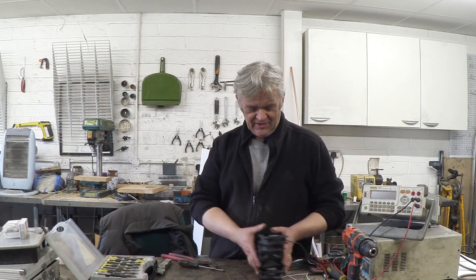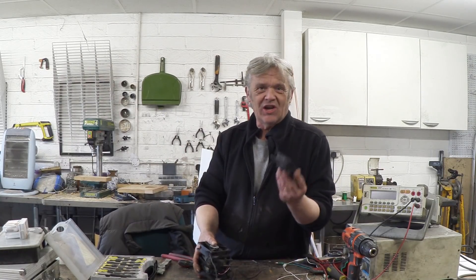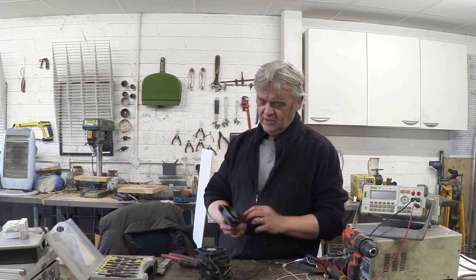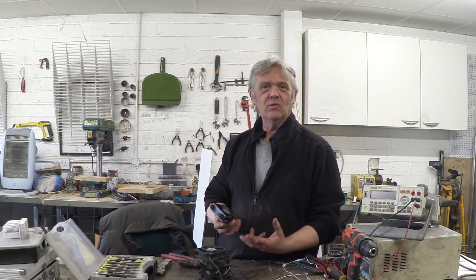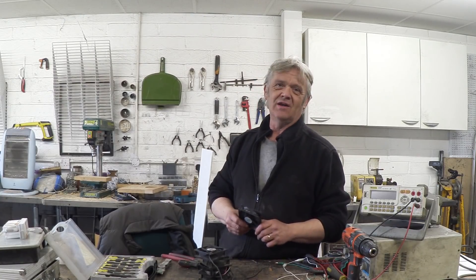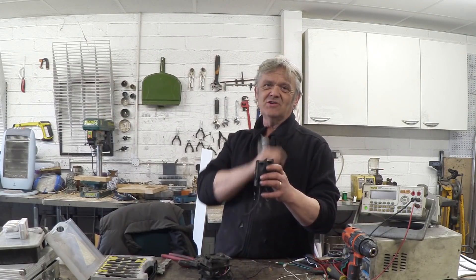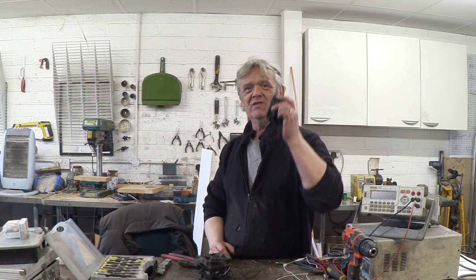These things — I think they must breed. I have loads of them; they just collect. These aren't DC motors; they're actually brushless DC motors — they've got no brushes in them. This was the big issue with dynamotors, and here we have a solution without brushes. I was driving home last night and it occurred to me that if we took two of these, glued one to the other, left one as a DC motor and made the other into a generator, we'd have an incredibly robust inverter.